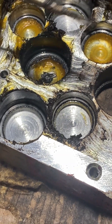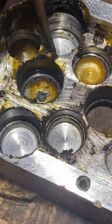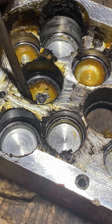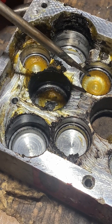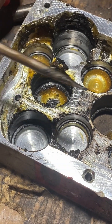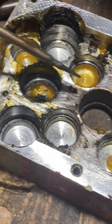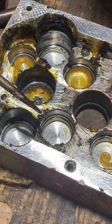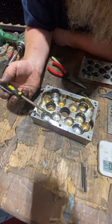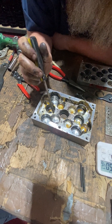This head is probably on the verge of 20 years old, if it's not already. At this point, to fix it we would have to replace all the gears, all the bearings, and the housing — and at that point they would still have an old head. Whatever components we could save from this have had a long wear and tear life. We don't see any signs this head was ever rebuilt before, but unfortunately they let it go a little too long with the spindles moving up and down.